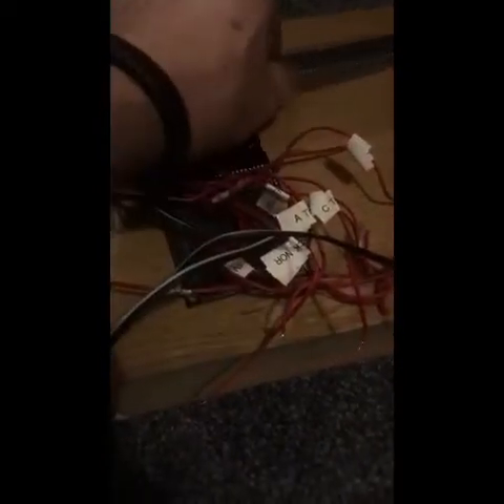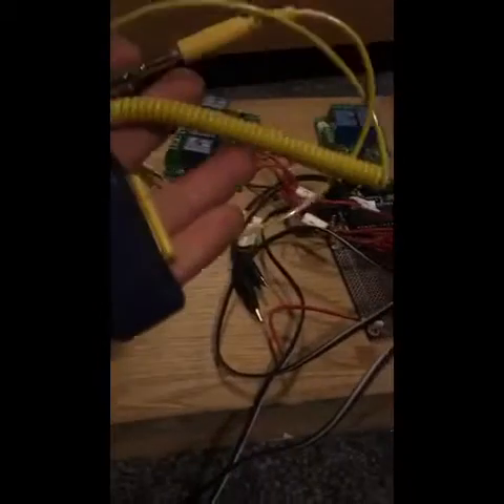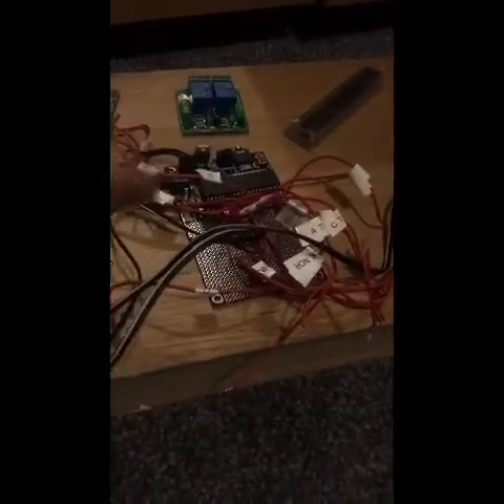You can order the board and chips online. With all microchips you should use an insertion tool; these are reasonably hardened against electrostatic discharge, but an electrostatic wrist strap and a removal tool are recommended. We're going to program this microcontroller, and it's going to be run off a USB power supply — four and a half to five volts — which runs the actual microcontroller.